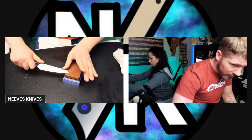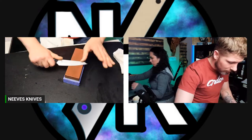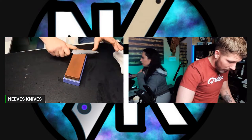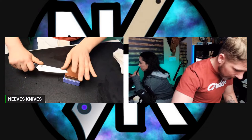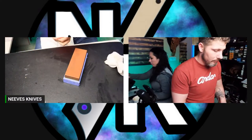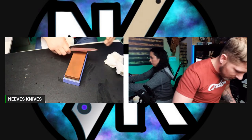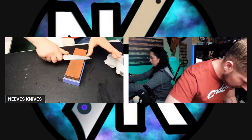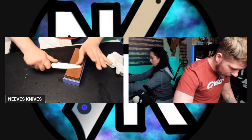Now you guys notice this is taking me a little bit longer than I was hoping, and it's because I started on 1,000 grit. Right now I would be done with this if I had just started on the 220. The problem is that the 220 needs to be flattened. But I am almost done. I do have a light burr across a lot of the edge, but not the whole thing, so I need to continue until the burr covers the entire edge.